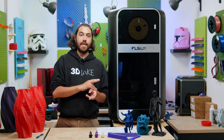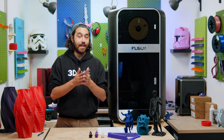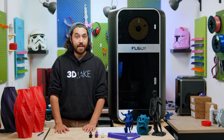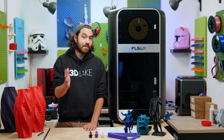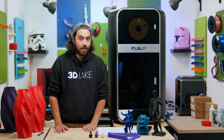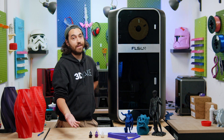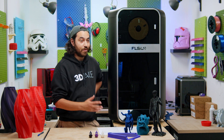After a few weeks of using this, I am quite impressed with how fast it can print. But the question remains: do you really need to print that fast? Everyone loves high speed prints and when they come out at good quality, that is really awesome. However, as we saw with our Eco PLA flow tests, you can't print at those very high speeds with a standard PLA — you need to use a high speed filament like PolyMaker's PolySonic, ESUN's EPLA-HS, or FL Sun's test filament. A decent standard filament will be able to print really fast on this — faster than your K1, than your Bambu Lab X1, than any other printer on the market really. But you can't reach those very high speeds. 1200mm per second is not going to work for a standard PLA — you've got to bring it down. 900 max. But this printer is enclosed, has a hardened steel nozzle, and has a dry box that goes up to 65 degrees. I don't think the engineers at FL Sun had regular PLA in mind when putting this together.